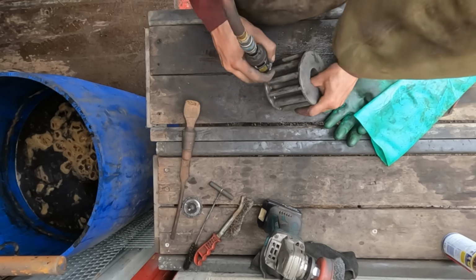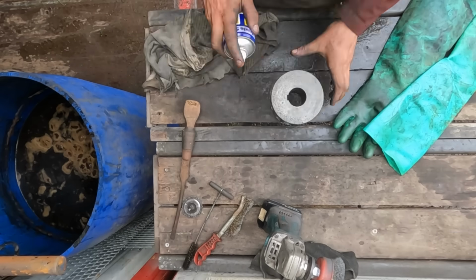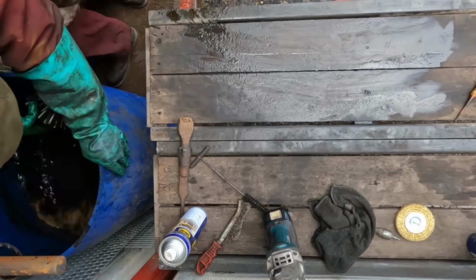For gear teeth like this pinion, which has sharp sides and so is very difficult to clean with a circular wheel, I like to take an ordinary mini brush, literally grind it into a point, and it becomes a really handy pointy spinny thing that can reach into all the nooks and crannies.